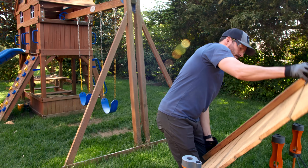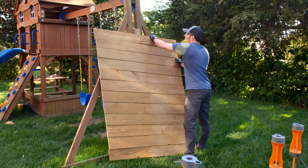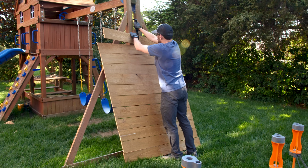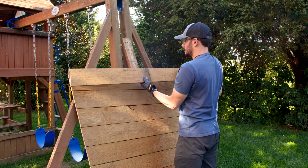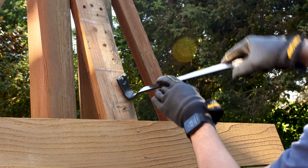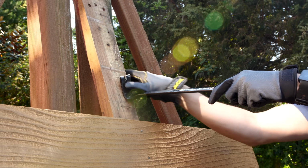Now, the middle section looked pretty darn good, and I just needed to get the boards off without busting them up. I tried a pry bar at first, but it was just ripping the boards off and leaving the nails. So then I had a big hole in the board and nails to pull out on top of it. And these ring shank nails are no joke, so it was time for another pivot.